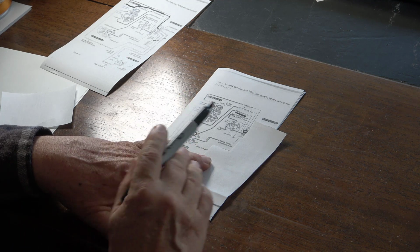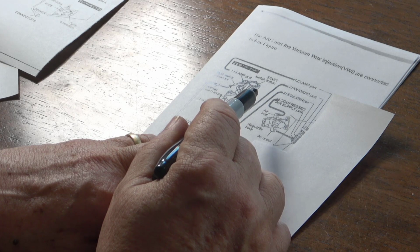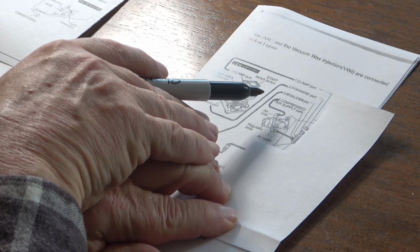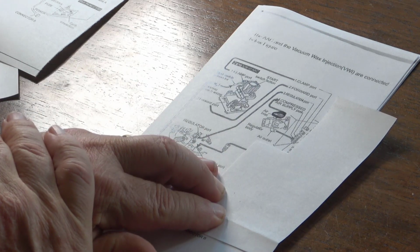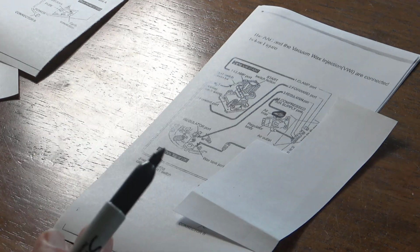Now there's some other things that get in the way. The compressor air supply is supposed to be a 6mm tube. I have a 6mm connector on the compressor. But the air inlet right there is an 8mm port. So it should be an 8mm connection. How do I solve that problem?